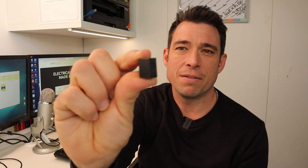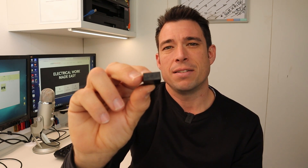I was going to use it to connect my pool equipment up as well, except the only problem is the relays inside are too small. There's nothing wrong with them, but for a non-resistive load like a motor or a pool pump, it's a bit too much. The pump that I have is 7 amps and the blower is 5.5 amps — these relays just wouldn't cut it. They're rated at 10 amps at a resistive load, and you can only put maybe half an amp to 1 amp small motors on it. Any more than that would be too much for the contacts.